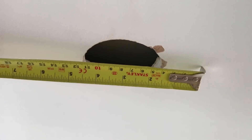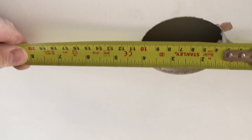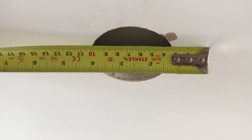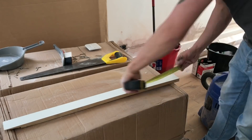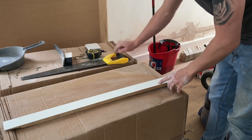First thing you're going to want to do, depending on what size hole you've cut, is measure it. You basically want an inch overhang either side. So if I put my tape measure there, I need a 5-inch piece of timber to give me an inch either side. Measure your 5 inches and roughly cut that on that mark there.